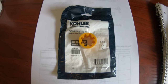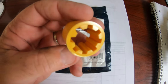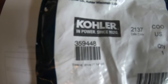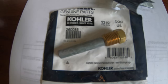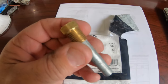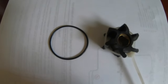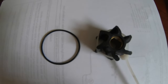In addition to a new impeller and o-ring, I got this little yellow rubber shaft — it's a connection between the drive shaft and the impeller on the water pump. I also wanted to replace the anode that was inside the heat exchanger. The anode rod is made of zinc, which is a sacrificial metal — it wears away instead of eating away at the inside of your heat exchanger. Here's the new impeller and o-ring.